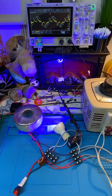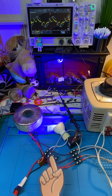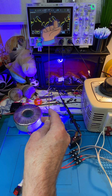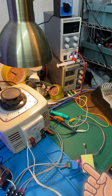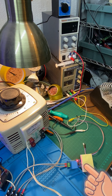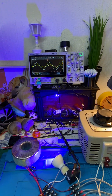The question I was asked was: what happens when you put an inductor in series with one of these lamps? I've done that and added a switch so I can short it out. On the scope, the blue trace is the incoming voltage and the yellow is the current. I'm obtaining the blue trace with this isolation module over here, which provides an isolated signal of the mains waveform. Let's zoom in on the scope.